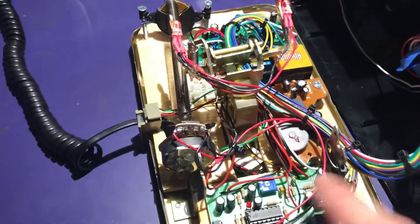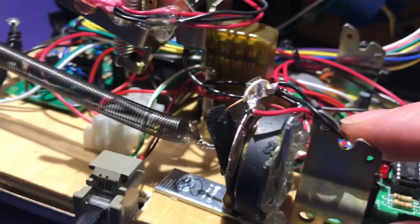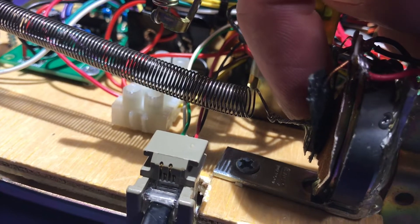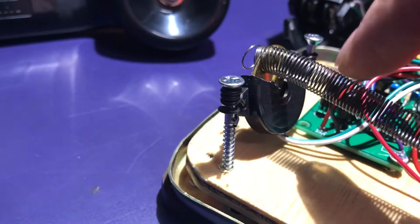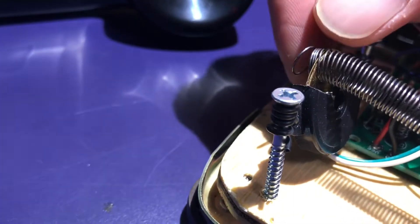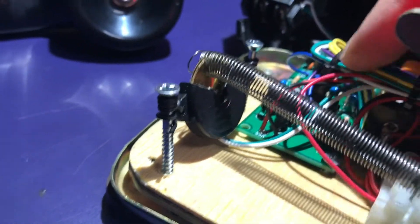That selects whether it goes through the spring reverb or directly to the delay board. When it goes through the reverb, the amplified output of the voice changer drives this speaker cone — the frame and the cone are cut out, but it still has the coil. I epoxied a little piece of wire to that little center part, so it still drives back and forth through the spring. There's no electrical connection between these two circuits — it is just a physical connection. That is just placed over the edge of a piezo disc, which is acting as a contact microphone.